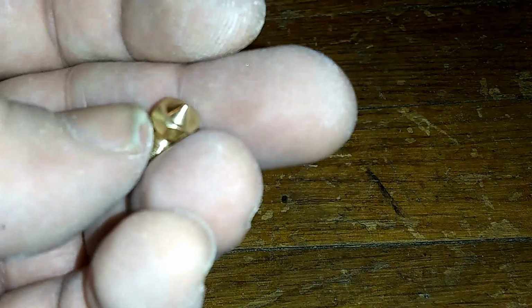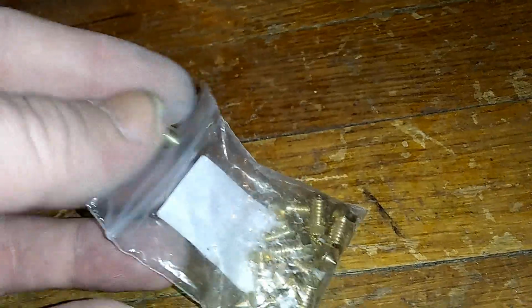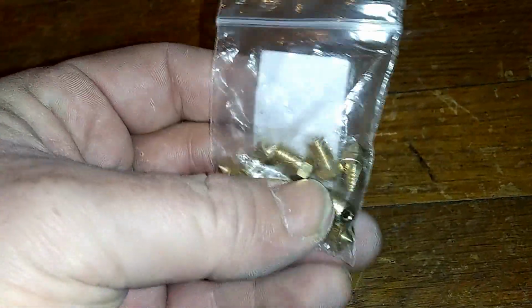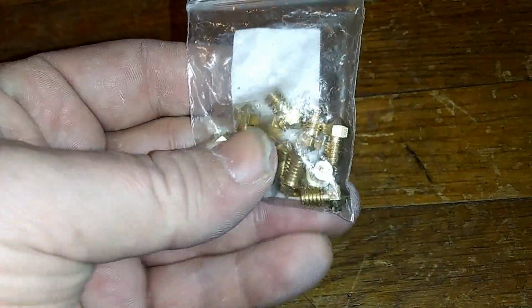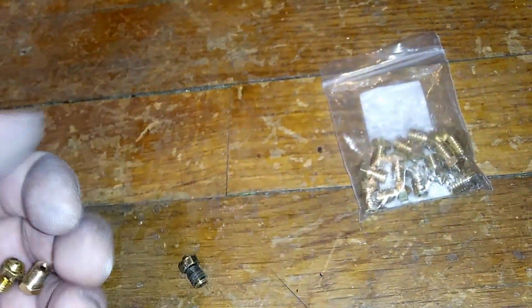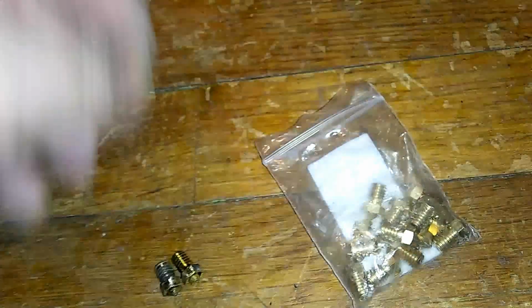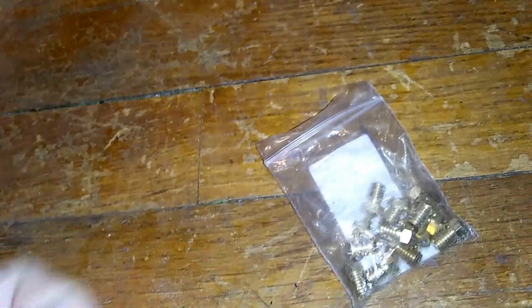So heads are important. In fact, since it takes so long to print these, I'm going to change out the head between every print, just because I want to get it done. And I've been working so long. You guys know that our subscribers want these ankle pieces, turning this into a TPU instead of PLA. I think I'm just going to switch out the head between every print until I get it done, just to be overly cautious, to make sure I don't have any clogs or damages. The head that's on there looks really good right now, so that's good. So stay vigilant with the head on your hot end. Get you some extra ones just in case, so you don't get frustrated like me.